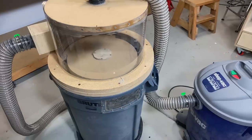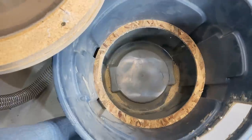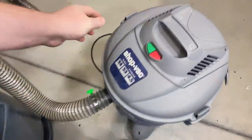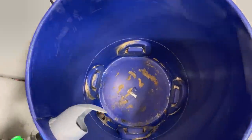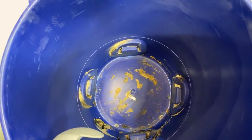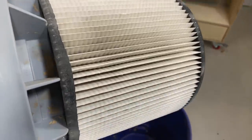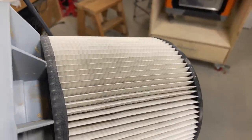Here's a better shot of the underside of the top hat. You can see the slot cut about two thirds of the way around the perimeter — that's what the dust falls through. There's also the port where dust and air come in and spin inside the chamber, then the dust falls down through that slot into the garbage can below. Let's take a quick peek inside before making sawdust to see the before state — almost nothing in there, and the filter is really clean.